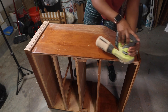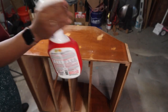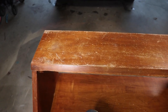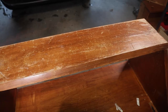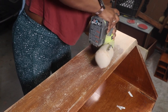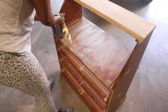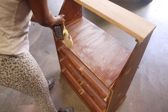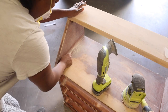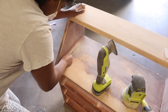When it's time for painting, it's a good opportunity to sand out any indentations or scratches. I came back in with Crud Cutter, sprayed and wiped it down since it's great for paint prep. I sanded the top down smooth because it had so many scratches, and I did the same for the inner portions of the desk.